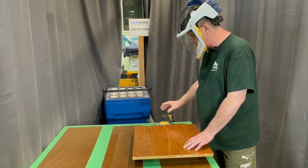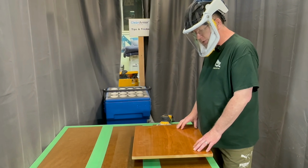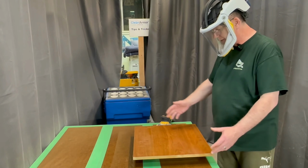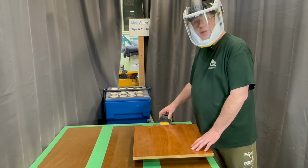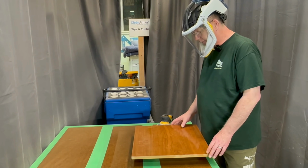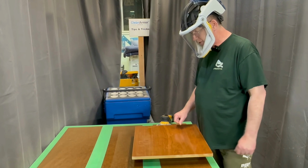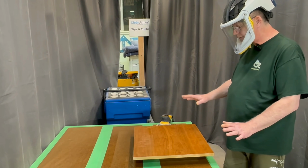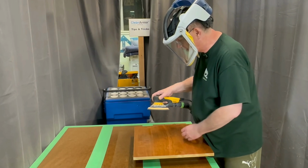So in between the second and third coat, I do like to give it a quick sanding with 320. But as I pointed out in the other videos, do not sand it down to the low points, because then you're sanding everything off again. So you go over very gently with the sander, very quick, just to get it very smooth. That's all. Because the Clean Armor is 100% solids, and any little dips and holes that you have between high and low points where material appears to be sitting and then where others have soaked away, that will be filled with the next coat, because now the wood grain has all filled and is sealed.